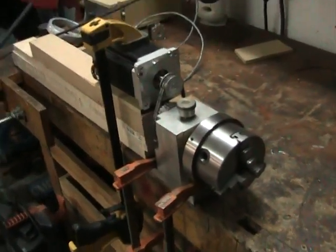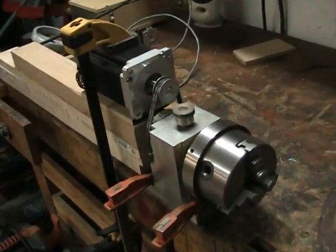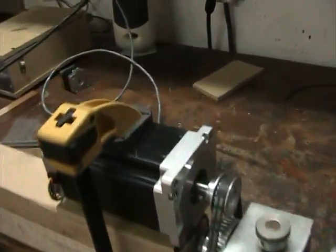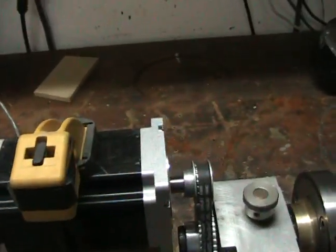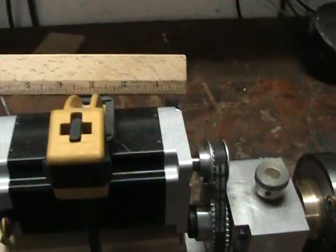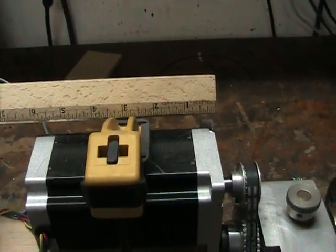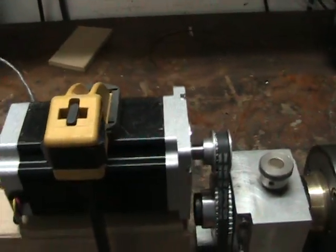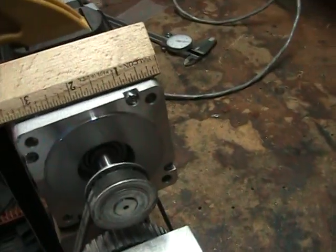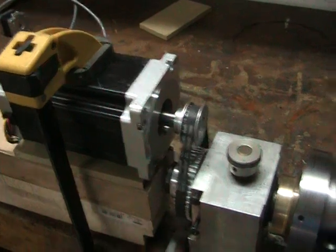This is a lash-up of a larger fourth axis I'm working on — these are parts I've had on hand for a while. The stepper motor is a NEMA 34, 1600 ounce-inch, which is a real monster. As you can see with the ruler, the body of the stepper by itself is six inches long, about three and a half inches square, and it's pretty darn heavy. I've just got it clamped up here on the bench to see how it works.